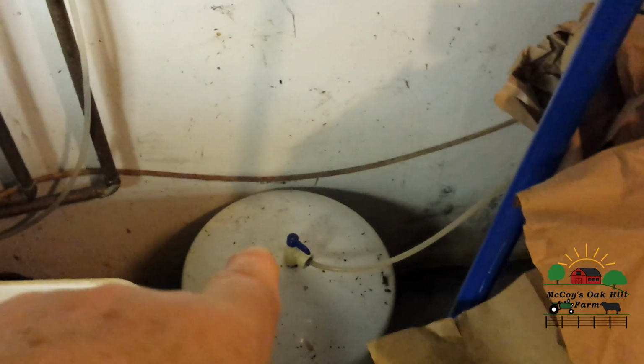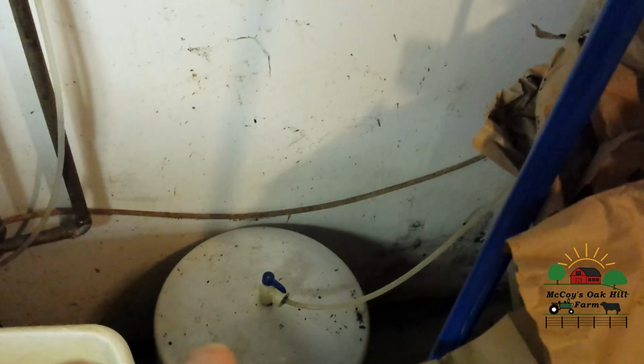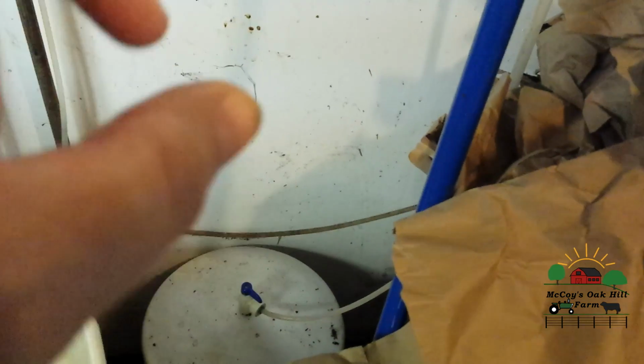This is the on-off switch. So when you're changing filters, you want to turn on draining your system, you want to turn that off, leave the water that's in there, because it'll pull it all out. It comes in here and it stores, and we've upgraded our tank. Actually, the only upgrades we've done to this whole system in the 16 years I've had it is we got a new storage tank, because it's a bladder tank, so the bladder will wear out on it after a while. We added the permeate pump.